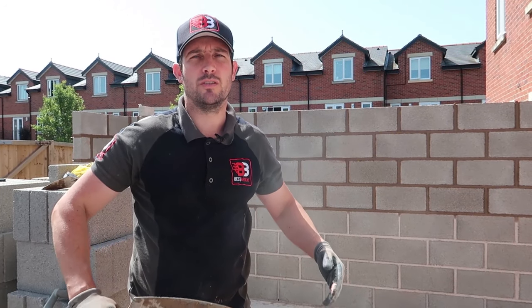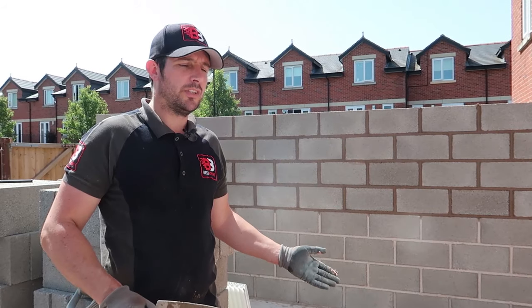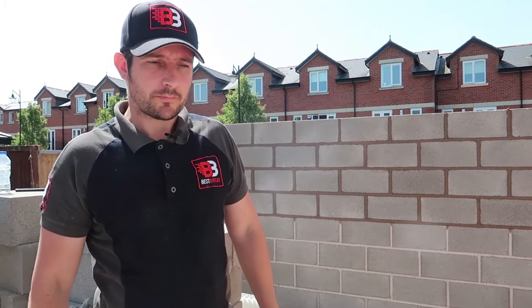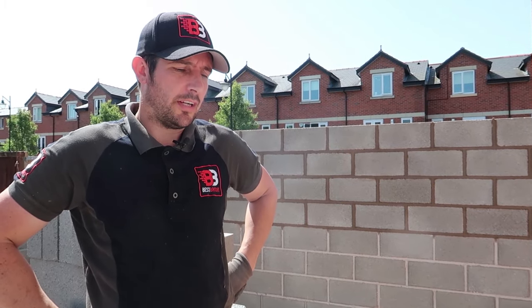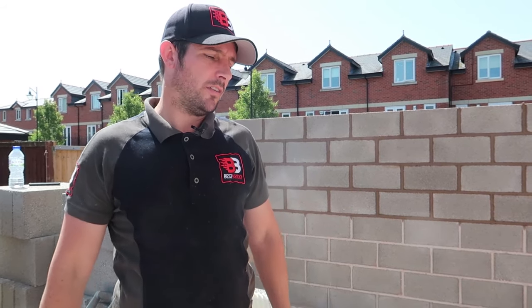The working time of your cement depends on the weather. It's really hot today, so as soon as you get it out of the mixer and it's on the boards, you're really limited on time. You've got to be fast, otherwise you keep having to add water and knock it up. There are many different ratios of mixes you can do. This is just a basic one, the standard one, which is most commonly used in bricklaying. There are a few videos out there with lime-based mixes, that's if you're doing stonework, and the general idea is never mix your mortar, strength-wise, stronger than the material you're working with.